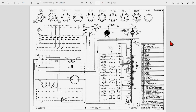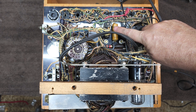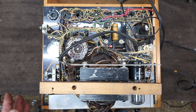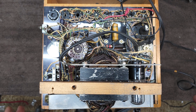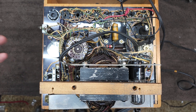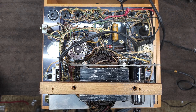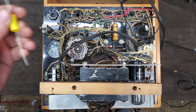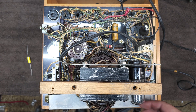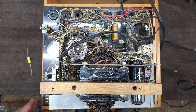As expected, here is our one wax paper capacitor that has to be changed. This unit is all original — it doesn't look like anybody's been in here hacking or chewing it, which is nice. It's nice to get a piece of equipment that hasn't been molested. The procedure for me is to go with a cleaner on all the contacts, change this capacitor — I happen to have a 630-volt 0.1 that's going to fit in there nicely — check the 5Y3, and put a new pilot lamp in it.